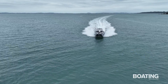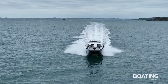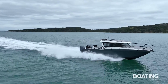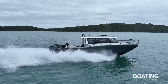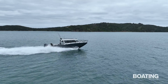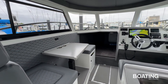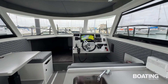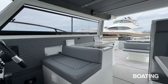With an outboard powered catamaran configuration based on asymmetrical hulls and a dihedral hydrofoil below the waterline, LaserCat aims to continue their reputation for a smooth riding hull while adding the considerable benefits of a catamaran. At the same time, they have retained the merging of aluminium hulls with other materials to give the best of both worlds — the strength and rigidity of an alloy hull with the warmth and sound absorption of composite and plastic cabinetry and finishings.